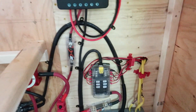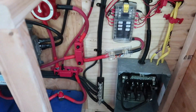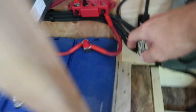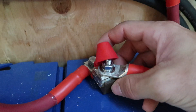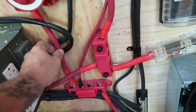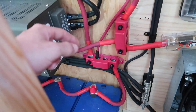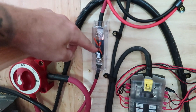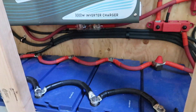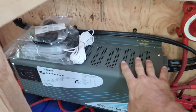One thing that boggled my mind was getting all the wire gauges right, so I'm going to run through every single wire in this system. I'll put links to everything in the description. 2-0 wire on the positive and negative from the batteries goes to a fuse — I think a 300-amp fuse — connected straight to the positive terminal going to the positive bus bar. With every positive that comes off the bus bar, I have fuses: 80 amps to the charge controller on 8-gauge wire, 100 amps to the 12-volt system, and 350 amps from the positive bus bar to the inverter, because I'm going with a 3000-watt inverter charger.